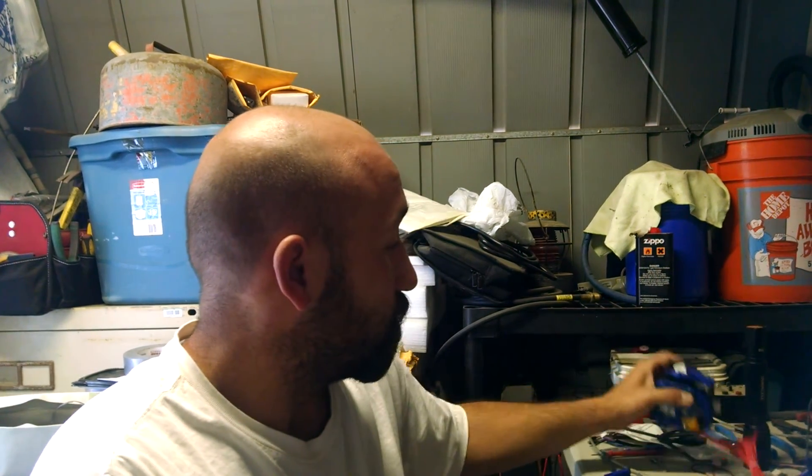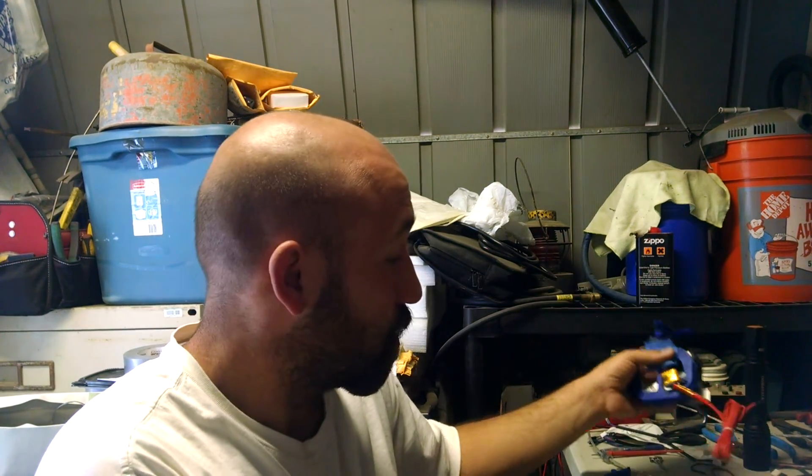The firmware again also has an option for Z-probe sled — I don't plan on doing that. Basically what I've enabled is just the auto level, thermal runaway protection for both the extruder and the print bed, and that's in case your thermistor breaks or loses contact. That's pretty much it. I've been having a lot of fun playing with this and trying to figure out ways to improve it with just what I have. For those of you with the Pro-C, you can set it up here — I'm running a Pro-B. I basically just designed the bracket off the fan, so anything with a 40mm fan that this is lined up for, perpendicular to your bed.